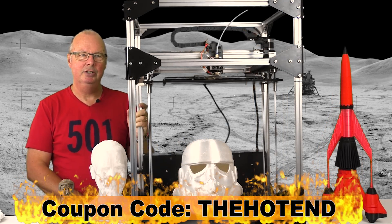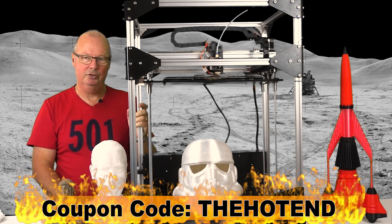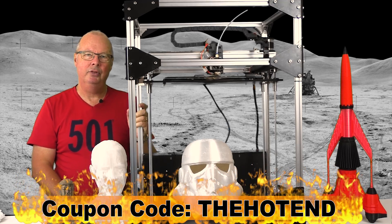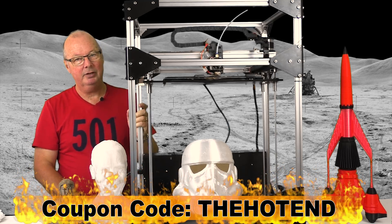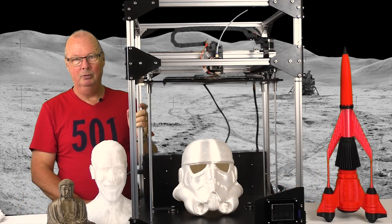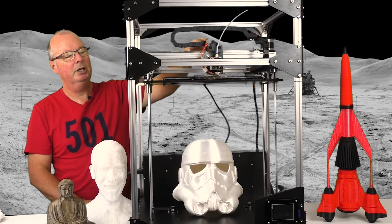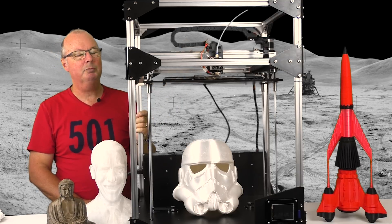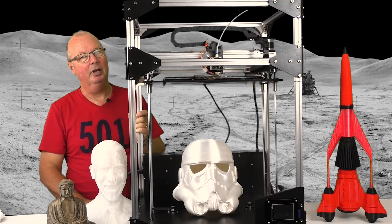Because the bed size is 12 inch by 12 inch, the normal heated bed that came with our machines was way too slow to heat up — well over 30 minutes to try and get it just to 80 degrees, and I never got mine to 100. I believe that has been addressed in the newer printers, and I hope the newer ones have a bed that works better than ours did. It also did not come with a print fan. If you're going to use PLA you definitely need a print fan. It's easy to add — there's plenty on Thingiverse that bolts straight up — but it would have been nice if it came with one.